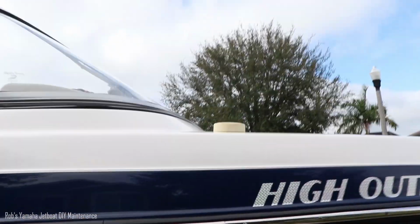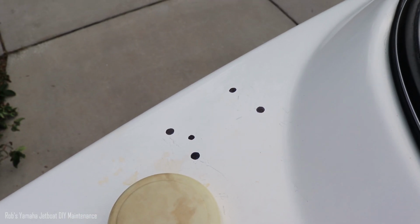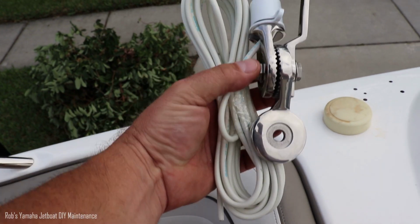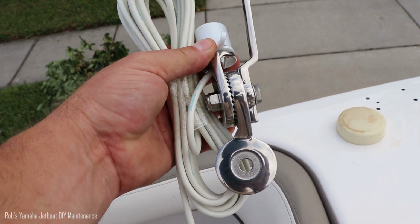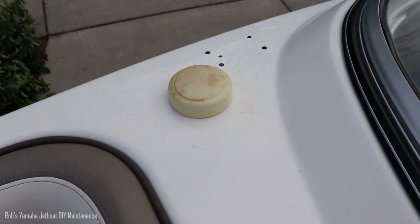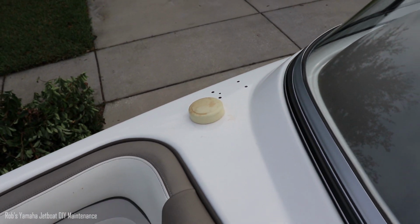Right up in here next to this puck is where we're going to mount Jeremy's VHF antenna. We got it marked out here. We're going to mark the antenna. We're going to mount the antenna. And he's got one of these quick connect ones he bought, so the antenna will come off if he wants to. It's a two-piece deal. So that's where we're going to mount it. So we're going to get underneath, make sure none of the harnesses and stuff are in the way, and we'll start cutting here shortly. But here's where we're going to put it.